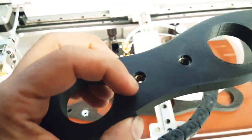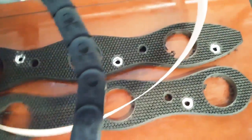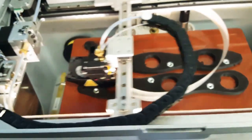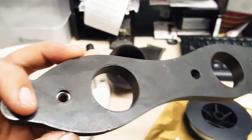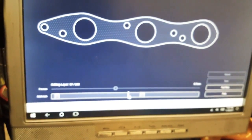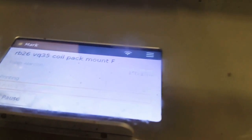At the end, you can see the nuts are sitting in there but you don't really see them from the outside. So this is pretty much the anatomy of the part. The threads are stronger on metal, so you don't want to use threads on plastic — that's why I use metal nuts. Then it keeps printing, adding more fiber, until it's done. It takes about a day and eight hours to finish, so roughly a day and a half.